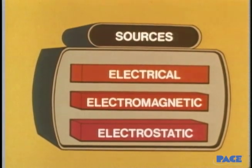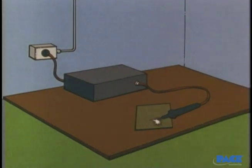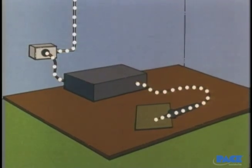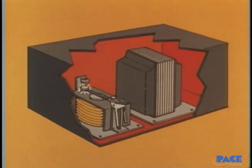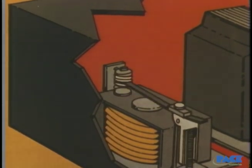We'll take the electrical ones first and look at a typical work situation. The board is in contact with a desoldering tool. It's connected to a power supply, which in turn is connected to the main source of electric power. There's a direct physical connection all the way through the system, and spikes appearing in the power line or generated in the equipment can pass straight through into the board and component. In the equipment, switching loads on and off, such as motors and transformers, can be a major source of the problem.